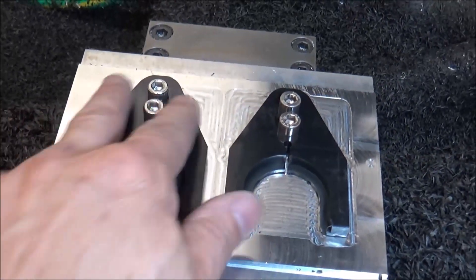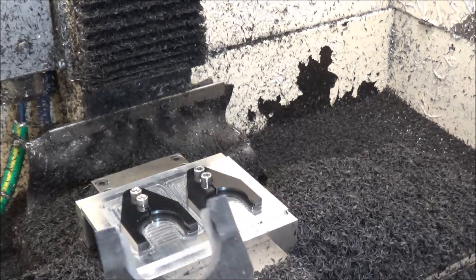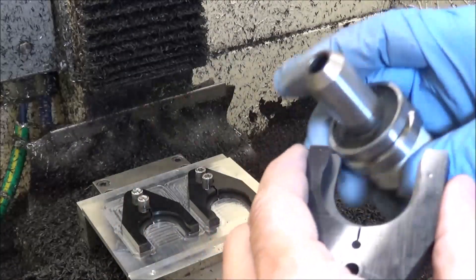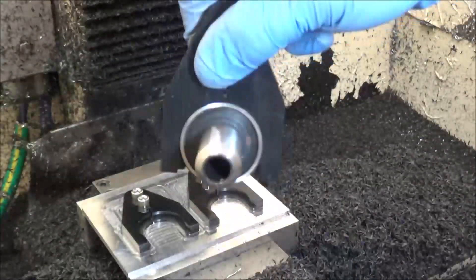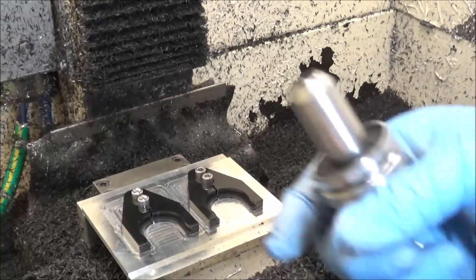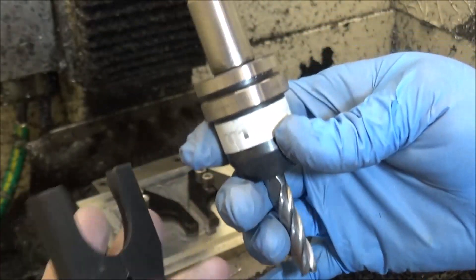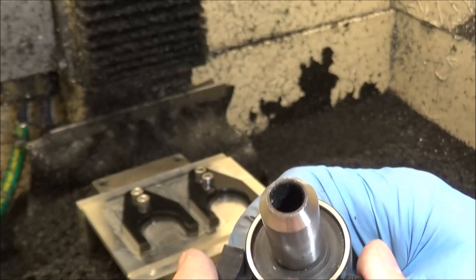You can see how we cut the tool holders — the tool forks — pretty easy. The reason I wanted to go with plastic: in the plans it called for aluminum, and those will probably work just fine, but it also called for a little plastic piece to kind of lock it in there. With the plastic you can just incorporate both of those pieces at the same time and it's secure. I think the plastic will be fairly durable. I was worried about the aluminum — as it's going in there, when it rubs it's going to mar and become sticky. The plastic has enough lubricant built in that it's going to be just fine. You can hear it kind of snap into place — I think that's going to work just fine.